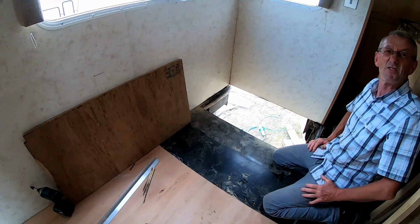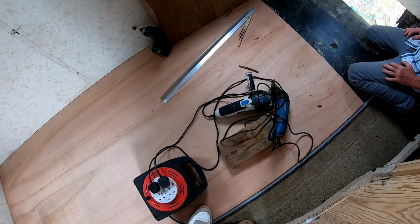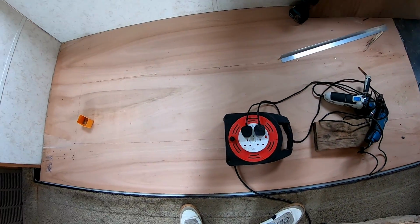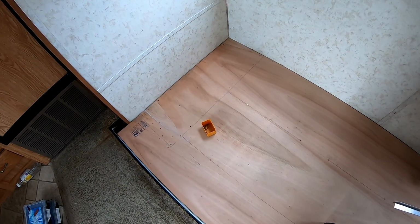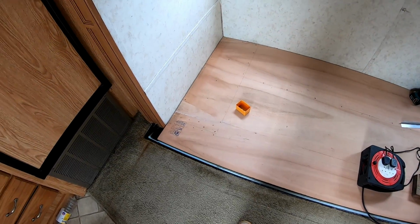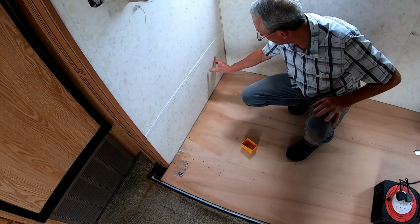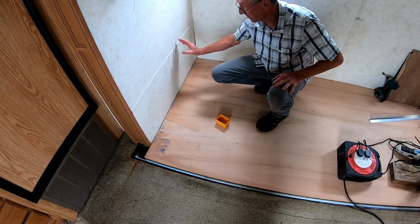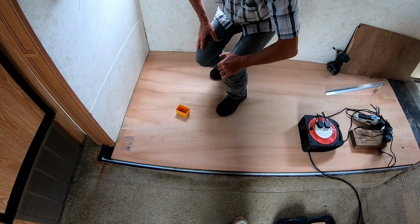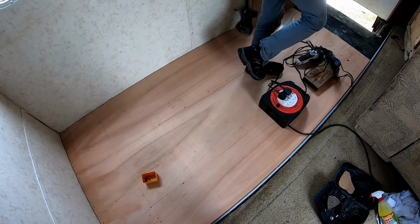Right, and so that should be good. I've got plenty of screws in there. Yeah, we'll just sandwich it together. And that'll be a good repair. There you go. And the wall's all right? All the walls okay? That wall was, the water just crept up it, so I've repaired that wall. Oh, I see. This bit here, yeah? That's it, up to there. I cut that panel out to there, because it had just crept up and done the corner, so I put a new panel in there and put a trim in there. I see all the screws in the floor, so pretty straightforward job.